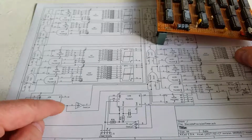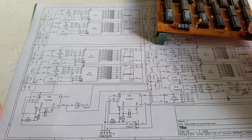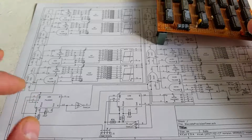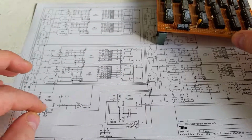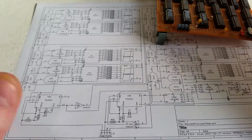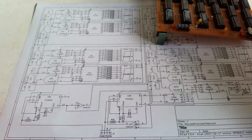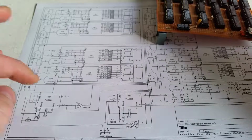So when you press the reset button, it creates a big enough pulse, because you don't want the press of the switch, which can have noise on it, to just keep turning on and off and doing funny things to the circuit. So I've created a long pulse here that when you press the reset button and release it, it's still holding in reset for a period of time after you've released the button to make sure there's no noise which can disturb the rest of the circuit, so you get a very precise count.